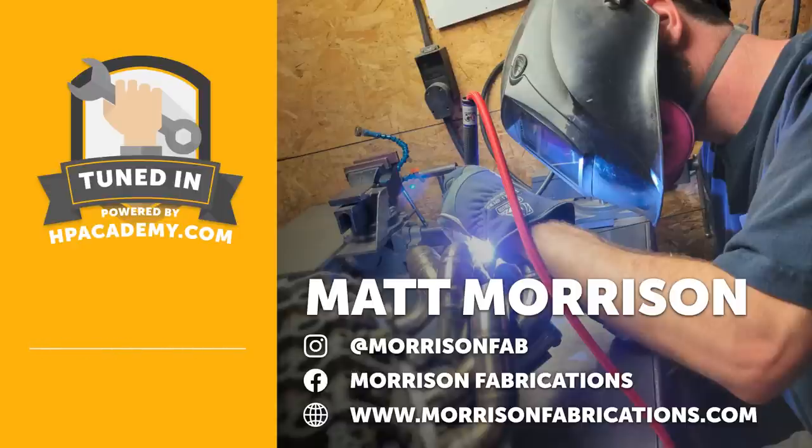A lot of enthusiasts think fabrication might be in the too-hard basket, but the reality is it's absolutely within the reach of anyone with a bit of attention to detail and a little bit of patience. That course teaches you the fundamental skills every motorsport fabricator needs. If you want to go further, we also have our Practical Motorsport TIG Welding course. TIG is synonymous with motorsport fabrication — it gives you the most control over the finished weld and puts the smallest amount of heat in, which is critical when dealing with materials like chrome moly. It also allows welding of mild steel, stainless steel, titanium, and non-ferrous materials such as aluminium.